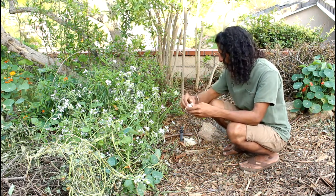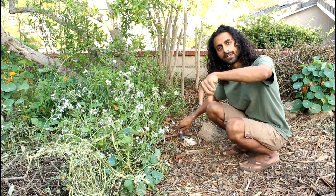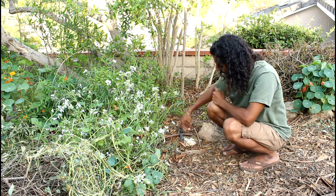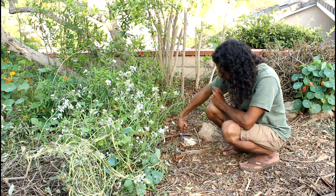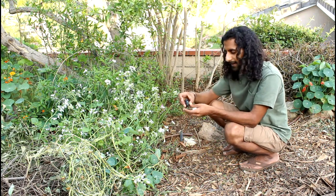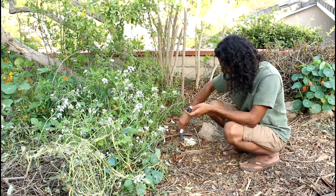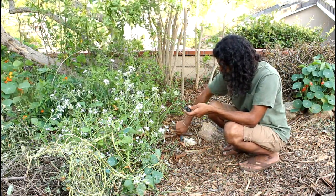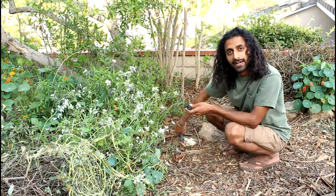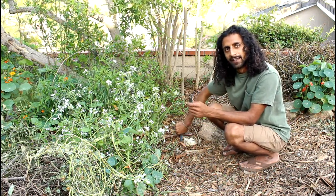The first thing we're going to do is find all the sprinklers on that one station, the sprinkler heads, and just go ahead and screw the sprinkler head off, then replace it with a cap. You're going to do that to all of the sprinklers on that one station and then move on to the next step.